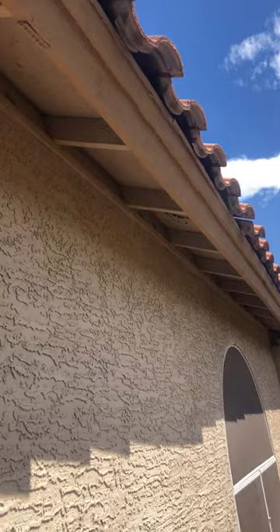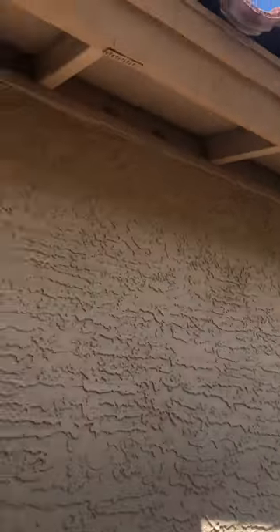This is where you're having that leak, approximately near this window. You can see right there evidence of water damage on the wood. Looking back here, not seeing too much on the plywood itself, until I come right through here — that's evidence of deterioration of the plywood, and something is growing on it. Not sure what. Let's keep going.